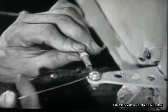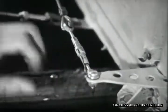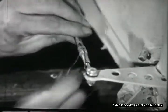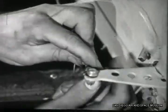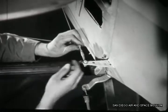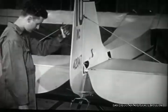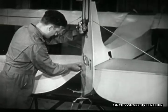This job is important so get it right: new soft brass wire through the barrel, through the eyes in opposite directions, back and around the ends. Cut off the ends, and you can be sure that turnbuckle won't loosen up until you want it to. Finally you inspect all your work, make sure it's right, then oil the hinges and call it a job.